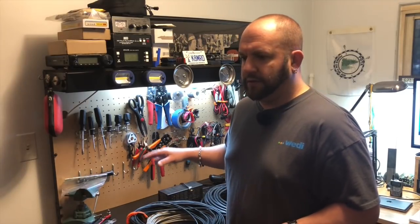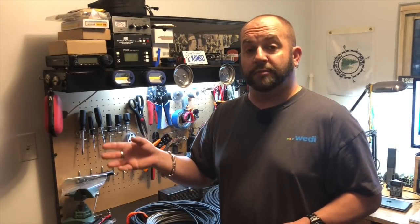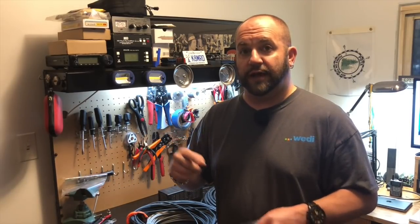I'm going to start with a short length of RG213 and RG8X as kind of a control, and we're going to take a look on a wattmeter going into a dummy load at what the power is going into the wattmeter with a short length of coax, and then we're going to compare that to longer lengths of coax. Keep in mind, this is not a very scientific test. There are literally books written on all of the different factors that come into play between matching your transmission line and your antenna, and power is not the end-all, be-all to getting your signal out.